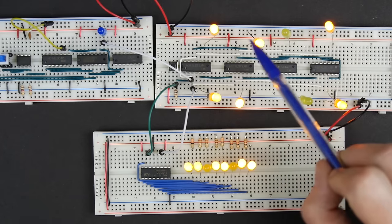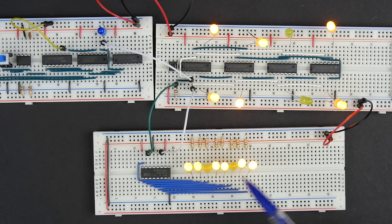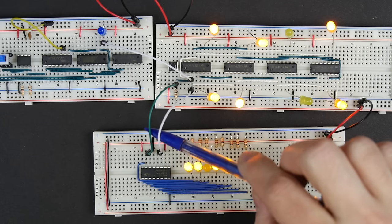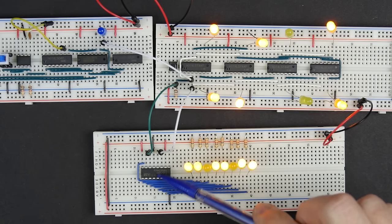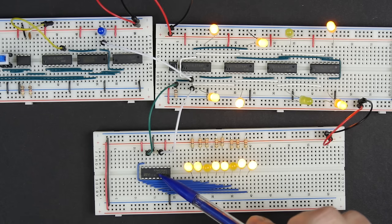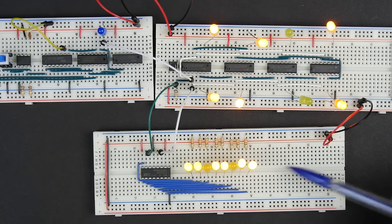And you can see we've got 1101011, and that's the same thing that we've got down here, 1101011. So great, using just two pins, and these could be two pins coming from our Arduino, we can control 8 or even more. We could cascade these, like we could have the last output of this go into the input of another one of these 74HC595 and get 16 additional outputs here. So this is perfect.